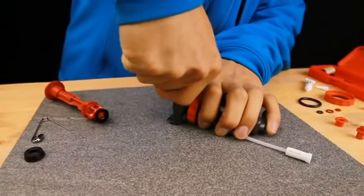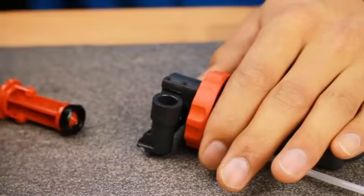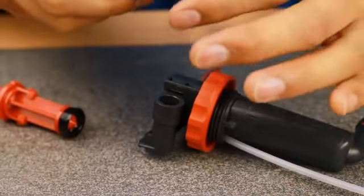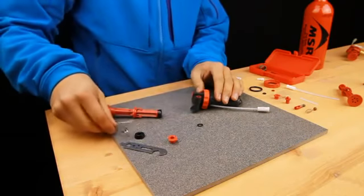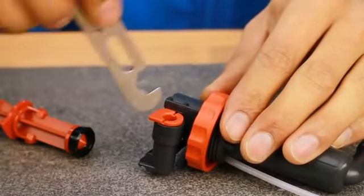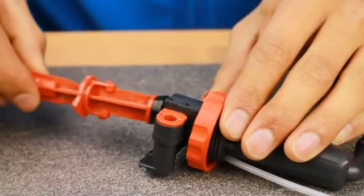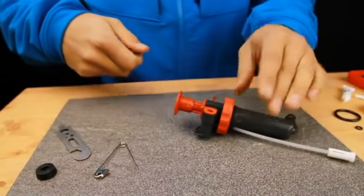While you have the plunger out of the pump cup cylinder, you should check the fuel tube bushing for any corrosion, dryness or cracking. Replace the O-ring if it is damaged in any way. Apply some pump cup oil to the new O-ring to lubricate it before replacing the bushing. Once the fuel tube bushing has been refitted, replace the pump shaft by lining up the bushings with the shaft and locking it in place.